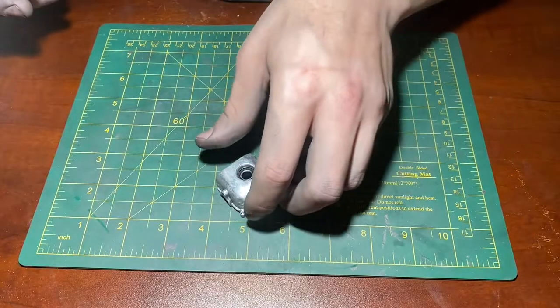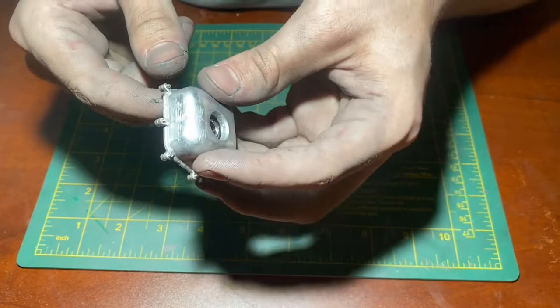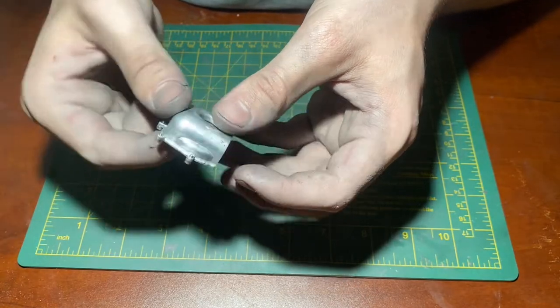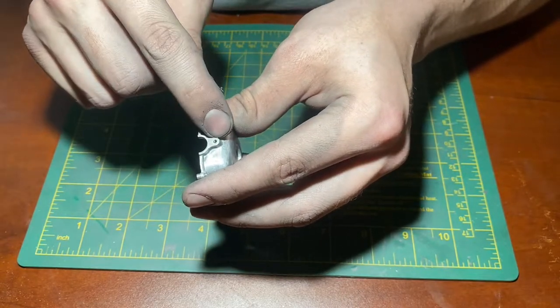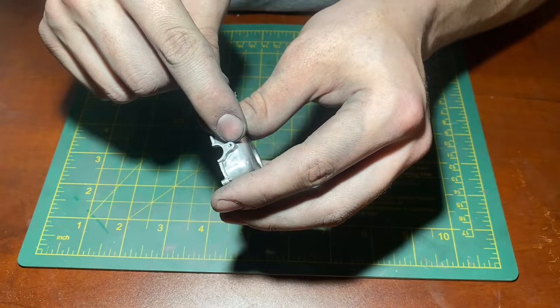This is the crankcase we just cast, and I think it looks really great for our first attempt. All four of the holes that hold the two crankcase halves together cast well. I was able to tap each hole and successfully thread a screw into them, as you can see. The carburetor mounting port also looks really great. The through hole cast well. I was able to tap it successfully, and this is the hole that accepts a screw that holds the carburetor